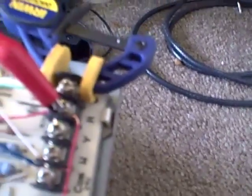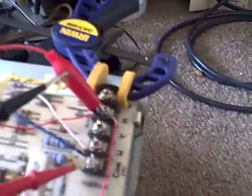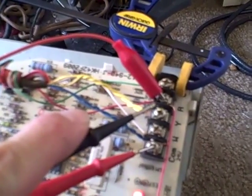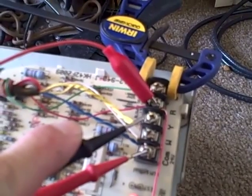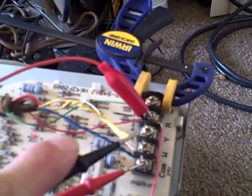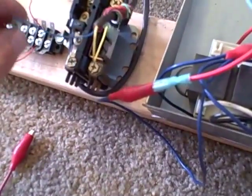I've gone outside and removed one of the legs — or you can do both if you want — off of the contactor. Or you can remove one or both off the ones in the attic, the common and the yellow. Come back up here with your meter on continuity and check from common to Y. This is assuming you don't have a tester — if it beeps, you know you have a short somewhere between here and there. If it doesn't beep, you're good and you might have an issue with the contactor.